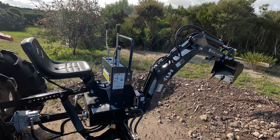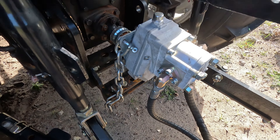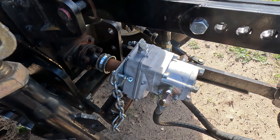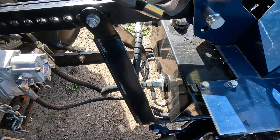It's just a little unit, but it's got a little pump that runs off the PTO on the tractor. It just chains on to stop it spinning, and then it's got its own little oil reservoir in there, and it's pumping the big tank of oil which is just in there.